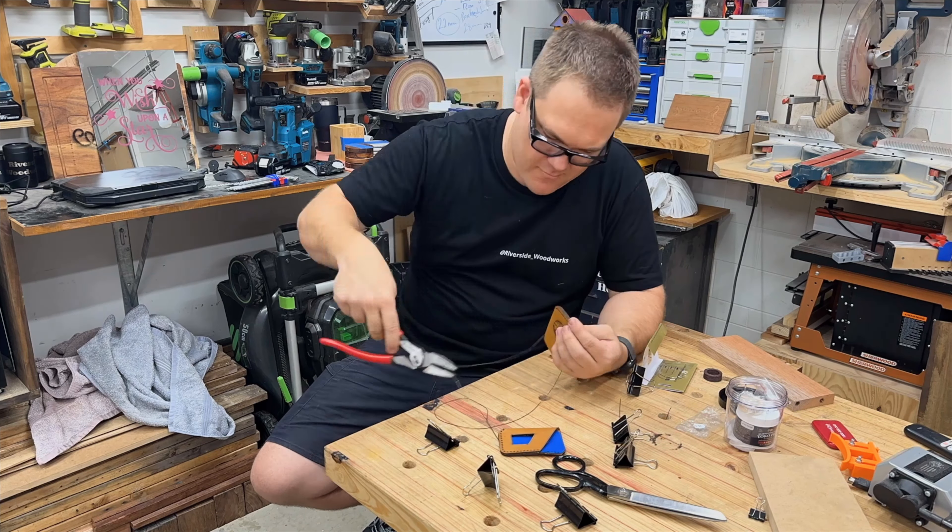To give you an idea of how popular and in-demand this product is, I posted a reel to Instagram and had 15 messages from people wanting their Yetis engraved. The tip here is to let your customers know it will take some time, and bunch them up so you can set up the rotary engraver and batch them out with the same settings all dialed in. If you want to buy this laser unit, there's an affiliate link in the description — it's a great way to support the channel.